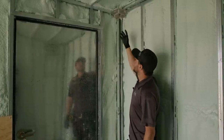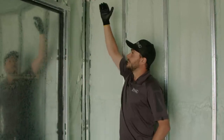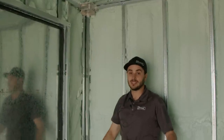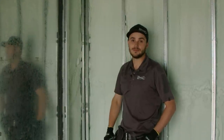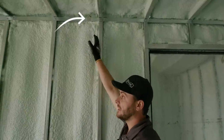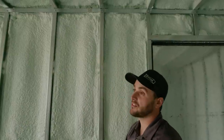This is what you're going to stare at when you're all said and done. If someone is looking to do a container home, maybe powder coat those black or something — but something you'd want to do ahead of time. Otherwise you're going to be losing interior headroom, or you'll have to build your end wall deeper. You could lose six inches of end wall or two inches of ceiling height without using these things. This here is our steel stud bracket after it's insulated — you can barely see it; it's all covered in foam. That small amount of metal is the only thing transferring cold in this container aside from the door. With this whole system, we have the absolute least amount of thermal bridging possible.